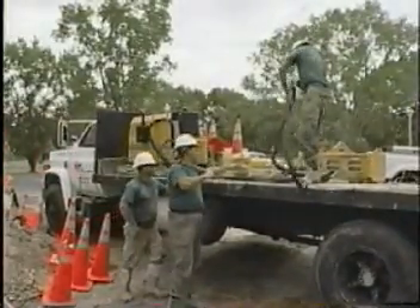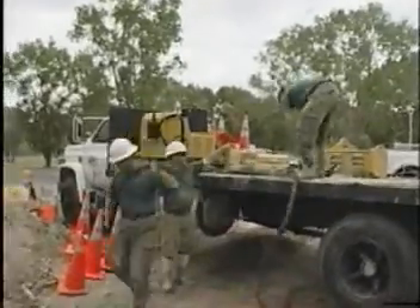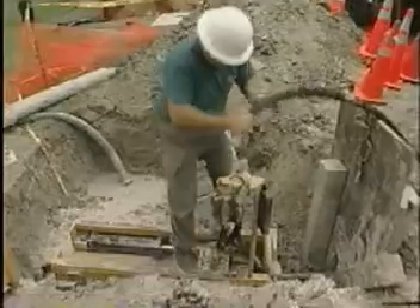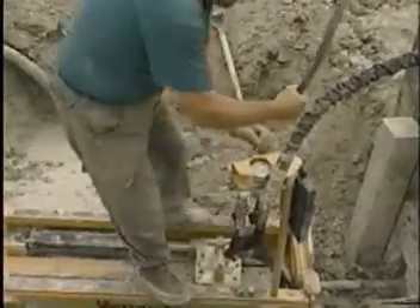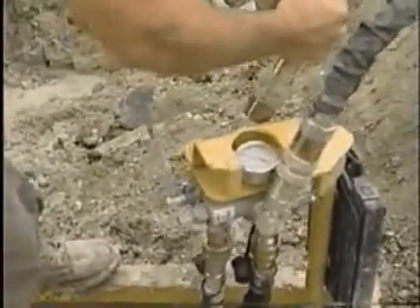As you can see, once we have the steel plate in position, we need to back the lorry in with the power pack and just hook up the leads to give us the hydraulic power to the bursting unit. Once the leads are on — as you can see how easy it is to get the leads on — we start the power pack, then we're ready to go with the bursting rig.